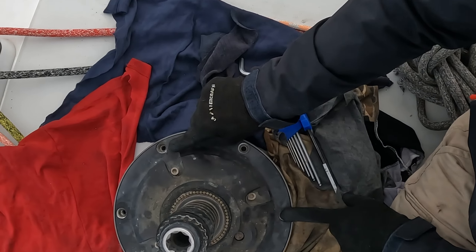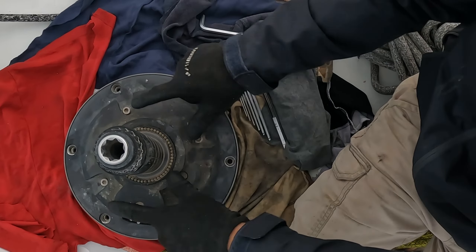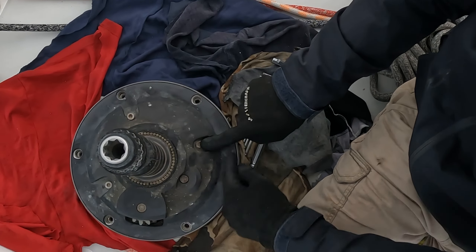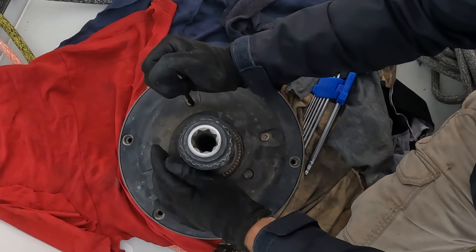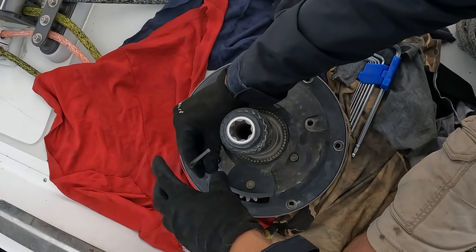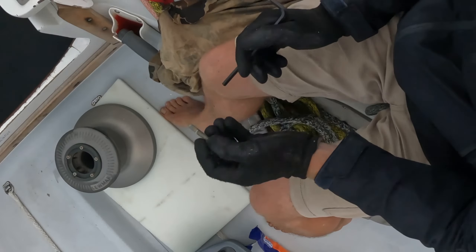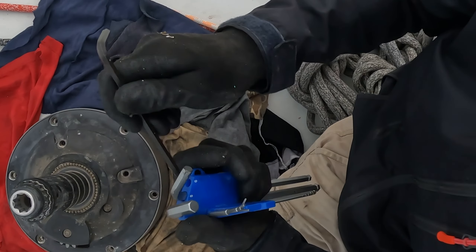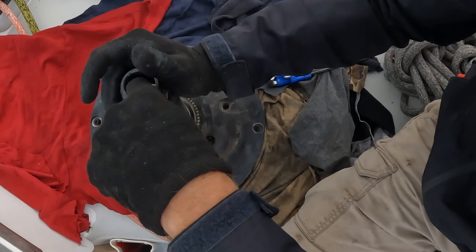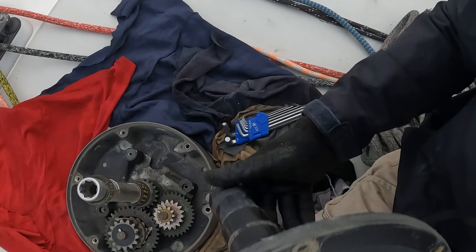They have got it, but only a very little amount — they're pretty dry, to be honest. Let's get these bolts out and take a look inside. We've got the last of our fasteners out; it's pretty shiny down each one of these holes, not rusted — that's a good sign. We're going to get these three center bolts off now. If I was doing this at sea I'd leave those three on and take the whole assembly inside the boat immediately so there's no chance of losing parts. And with those three — definitely got Duralac there — we should be able to pop this apart. Oh, that's a good sign — it's not stuck.